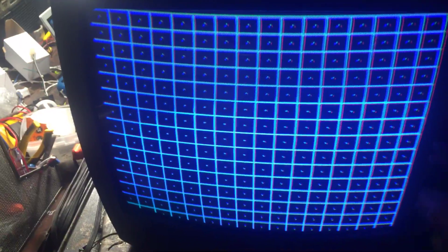I wanted to mention the issues I had after I got this up and running. Once it was bowed at the bottom here and bowed out at the top here, it turned out there was a bad diode in the vertical section behind those heat sinks. Both those transistors were blown out as well.